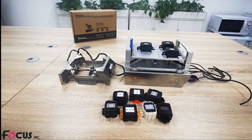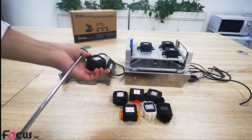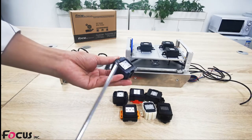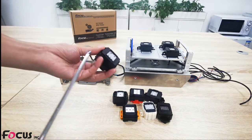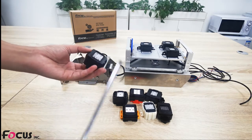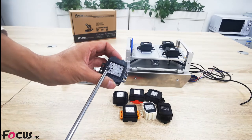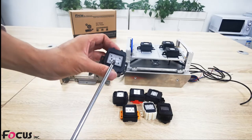So what kind of spare parts affect a good cap station? The first very important component is the cap — the head cap for the print head. Different print heads require different cap sizes, and caps come in many models, made from plastic or metal. The cap must be anti-UV and resistant to ink damage. The inside of the cap must be made from stainless steel metal — plastic is not good for UV inks.